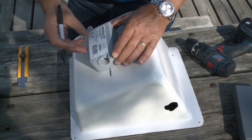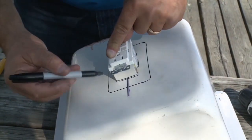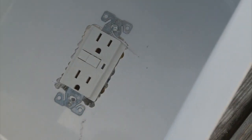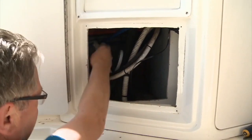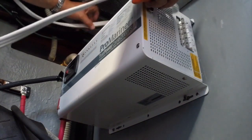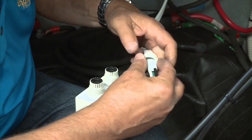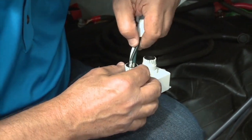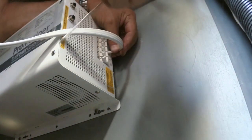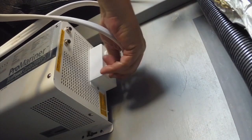After removing the locker liner, the outline of the electrical box and the receptacle were traced for the cutout. The receptacle was then inserted and the faceplate installed temporarily. Routing the AC input and output cables down below deck to the Pro Mariner Combi's location took some time. After prepping the cable and components, the cover was slid onto the cables. Then following Pro Mariner's excellent instructions, the input and output AC lines were secured to the correct terminals and the protective cover installed.